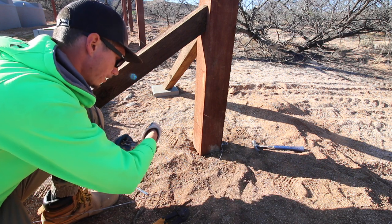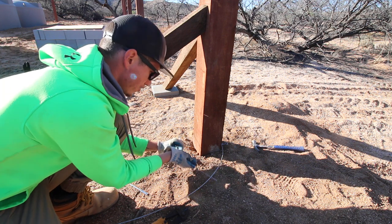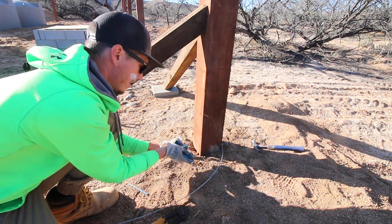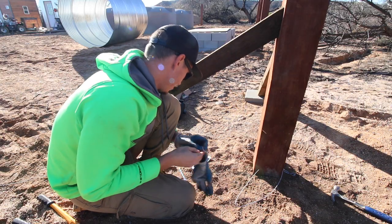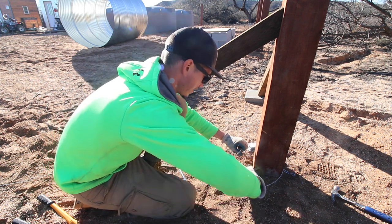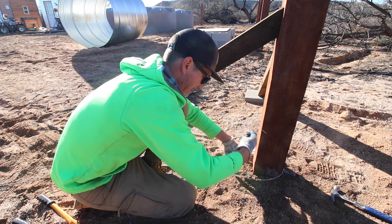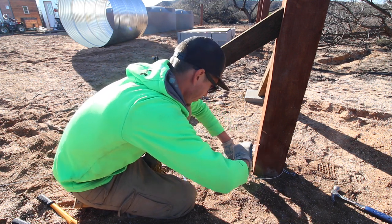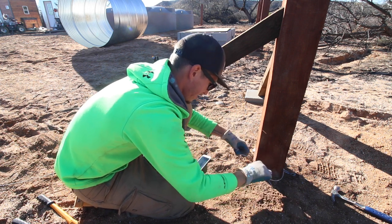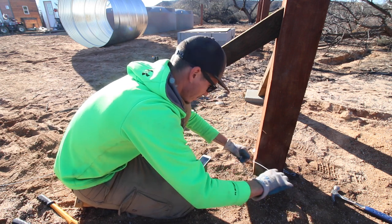Working the wire strainer on this side, we're going to make what is called a Western Union splice — not sponsored by Western Union, just FYI. I still need to look at a diagram on my phone because I've only done it four times and I'm still not exactly sure how it goes. This high tensile wire is not the easiest to work with, but it's super strong and the end product is going to be much better.